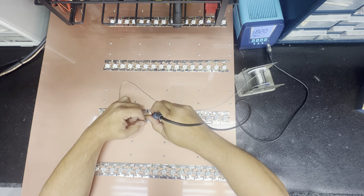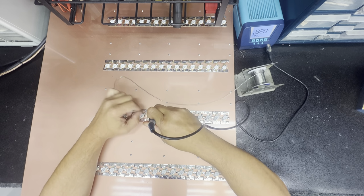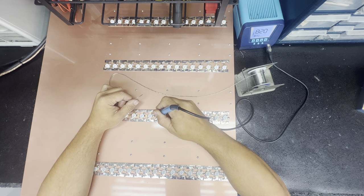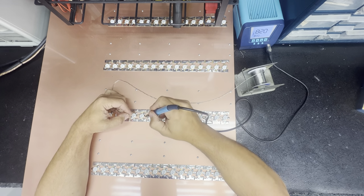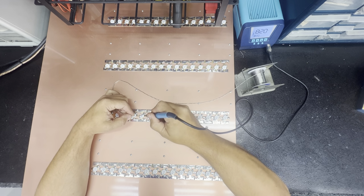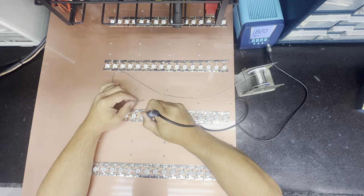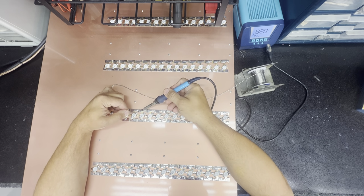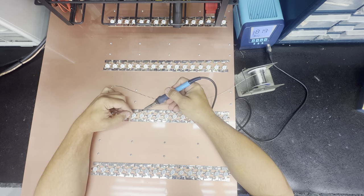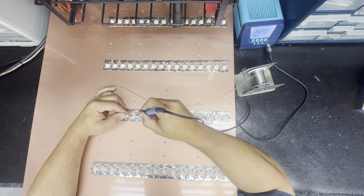That's 32 transformers on each side, so that's 64 transformers. Then you got swamping caps, I'm sorry, swamping caps. 64 of them. Then you got 32 caps on your transformers, 32 transformers lined up on one side, and 32 more caps, 32 transformers on the other side. 64 10 ohm linear resistors on your combiners. There's a lot to it.